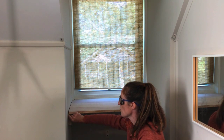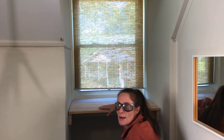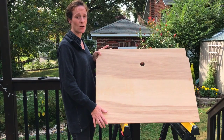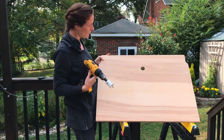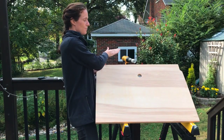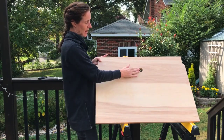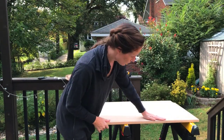I have cut these shorter by three-quarters of an inch because I am going to put a face along here. I've prepped my desktop and I'm ready to give it a coat of primer before I tack it onto the frame. I used a drill bit to put a hole in the top because I have an outlet underneath the desk, and since I'm going all the way to the back of the window frame, I won't be able to put a cord through the back — so I have to put the cord through the hole for easy access to the electrical outlet.